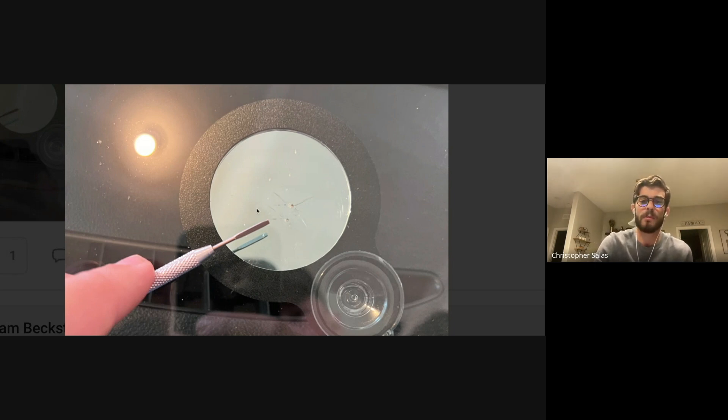I would do more cycles — that's probably where you're hitting the roadblock, maybe you didn't do enough cycles. As far as this pit, I was thinking that's kind of what you're talking about — this little hole right here. I'm assuming it's an air pocket, either that or it could be that you drilled too much or too deep into the chip. You possibly could have drilled into the laminate, which caused the laminate to deform, and you can see that little bubble right there — it shouldn't look like that.